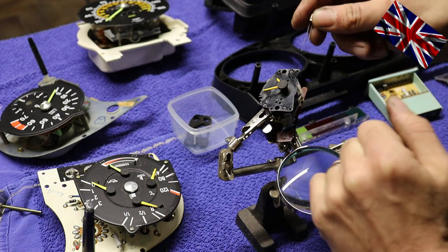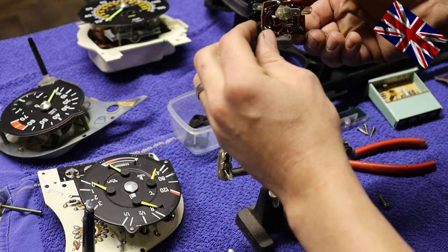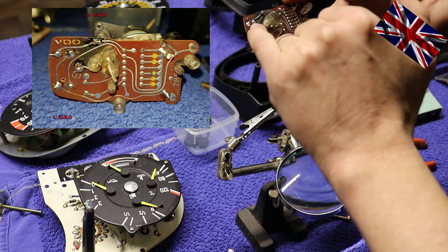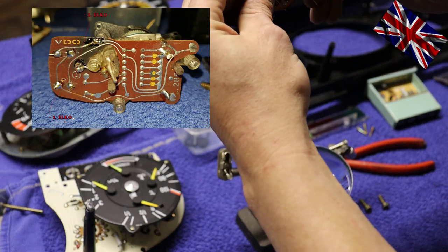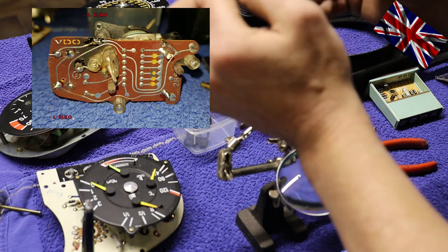You can see here where the minus current conducting path runs, it is clearly marked. So if I slide the feet through the holes, the plus foot should be outside at the far left. I now bend the feet to keep the capacitor in place, a job for a watchmaker for sure. I now solder it to the panel without touching other current conducting paths.